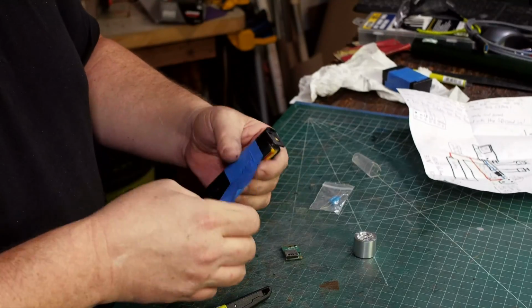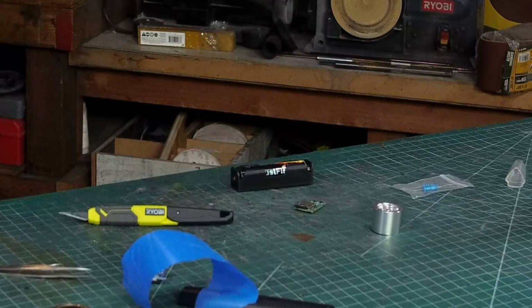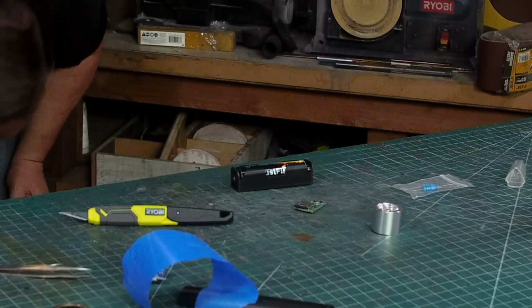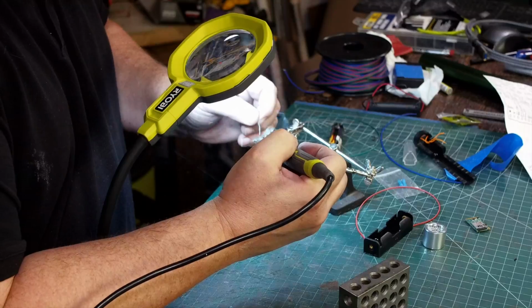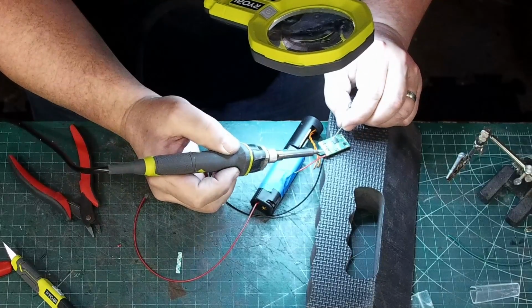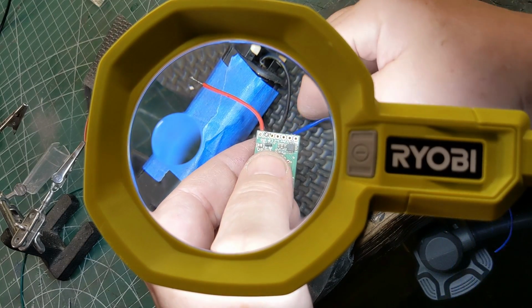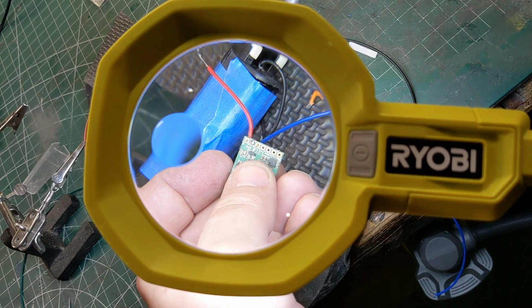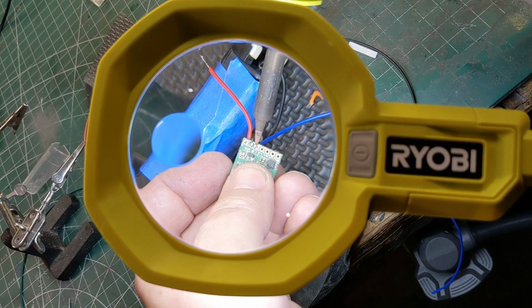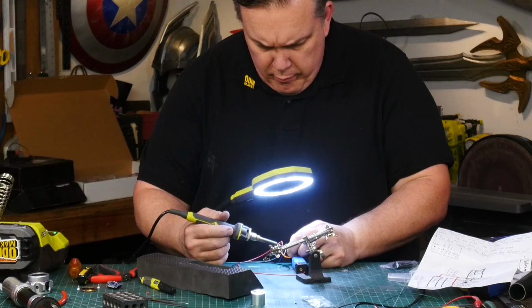Next, I check the battery and speaker combo. It's an 18650 rechargeable battery, but the holder will need some wires replaced so I can connect it to my project. I set up a space to solder and connect some new wires to the battery holder. Now all the connections for the biscotti board are just soldered right to the board as needed. And basically, there's main power, common ground for the blue LEDs, another ground for the white flashing LEDs, the power switch, and then there's the connections for the speaker. All of which I need to solder onto the board correctly and without shorting any of those connections.